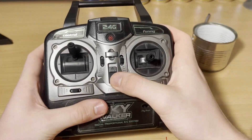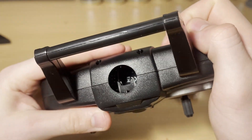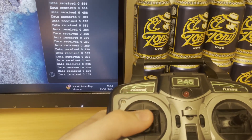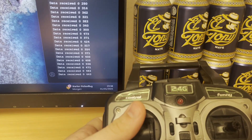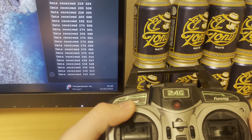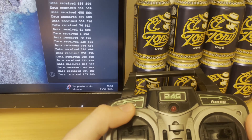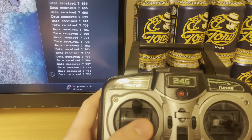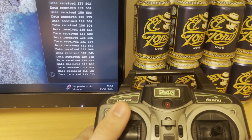Now for some weird reason the light doesn't seem to be turning on, but if we take a peek inside, we can see that the lights of the Arduino Nano are lighting up. Now I've written up some code that reads in the values and sends them out through the NRF24L01 module. I've also hooked up another Arduino to my computer with another radio module attached to it, so we can output the values to my screen. I'll put a link on how to set up an NRF24L01 in the description. As you can see, when I move the joystick around, the corresponding number is output to the screen, indicating where the joystick is currently at.